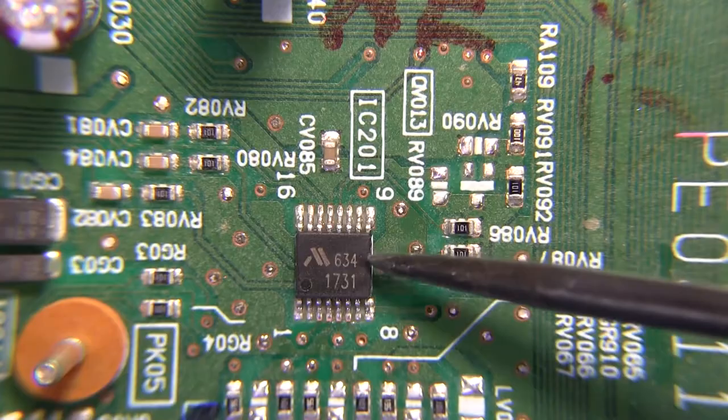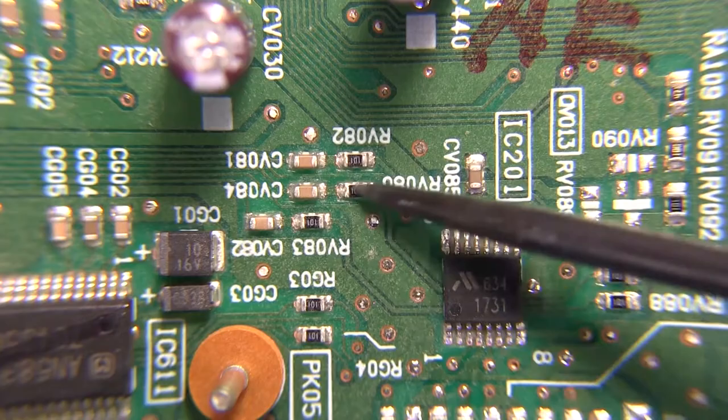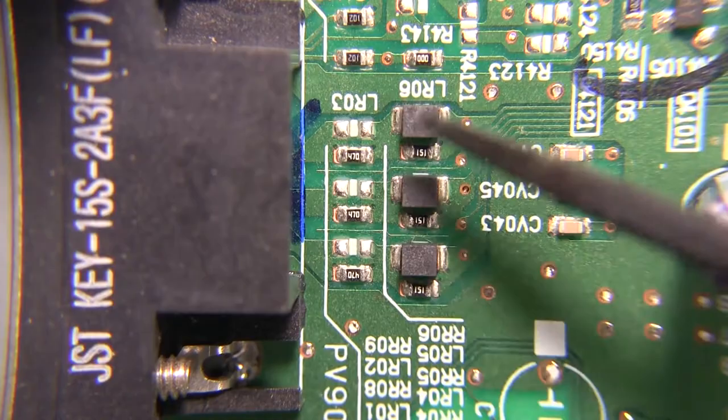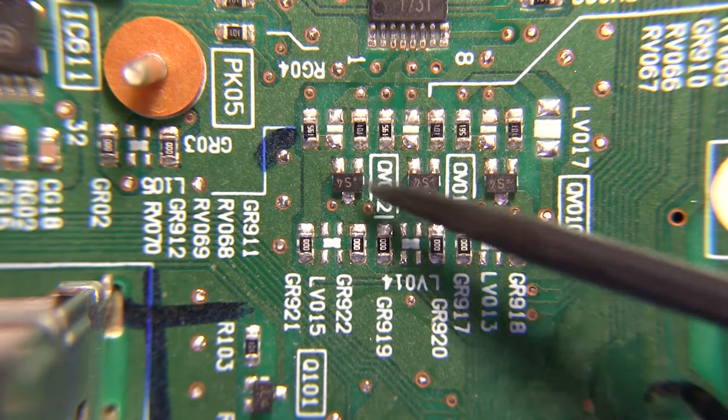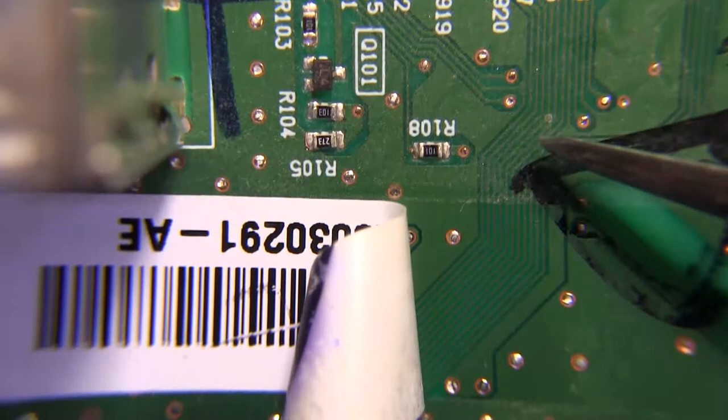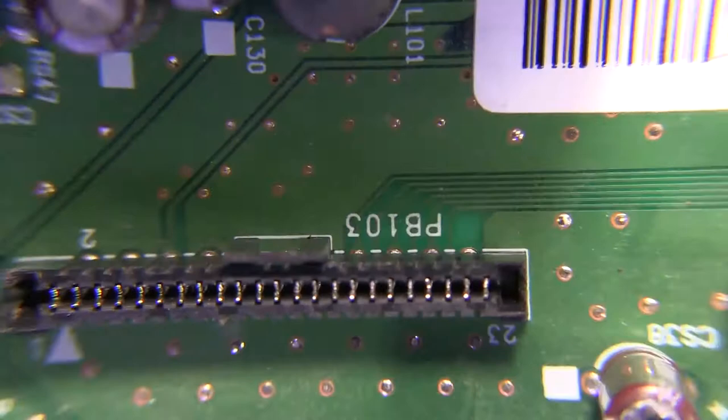This little chip right here is an MCP634. We've got three sets of a cap and a resistor, basically — this is a quad-channel rail-to-rail output op-amp. It looks like that's doing some amplifying from the VGA port. We can see a set of three filters here, and all that stuff comes off, goes through these, splits off into three, and then we've got another set of three outputs with some diodes, resistors, and some unpopulated stuff. Looking at the bottom of the board, the traces come down into this section of the connector, which then goes off to the big scalar board.